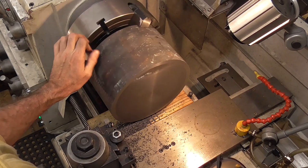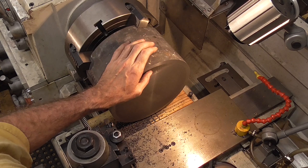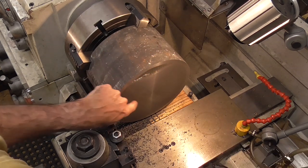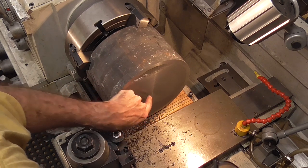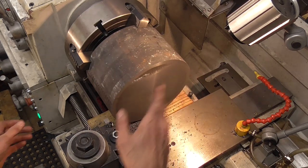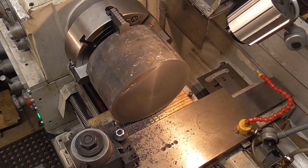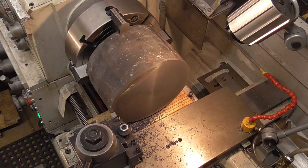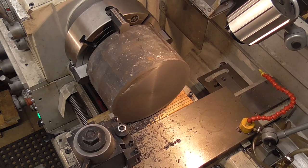Let us see what we have. And this is a little bit of chatter that we had with the wipeout. Then we have an area that wasn't cut into going across. A couple thousandths raised, center there. Reasonably smooth surface. It would be actually good enough for what I want to do. But I want to get it faced the whole way across. Set that. I'm going to take maybe another 5 thousandths off of where that was.